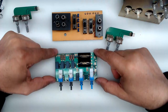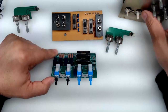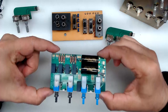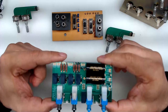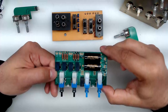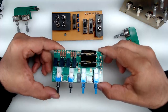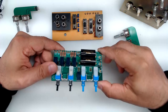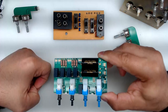There is one additional change which is quite major and in my view a substantial improvement over the original design: the ability to route signals straight from the rear RCA inputs all the way to the driver boards. To do that, I had to find a way to separate input one from input two in order to route directly to the driver boards while still retaining every function already in the original design. In the new assembly, all you have to do is leave your input selector on input one, which is its rest state.